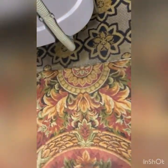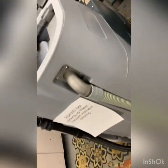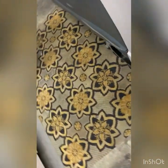So I'm going to go through and look at their issue. Not picking up water, the blinking. So usually we start with the electrical, check to make sure both vac motors are running. A couple years ago we did have to replace vac motors on one of these two units here, but this is the one we're going to be looking at, so I'm going to be waiting for the supervisor and check the recovery system on this unit.